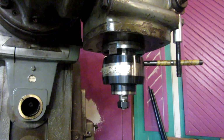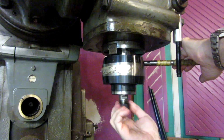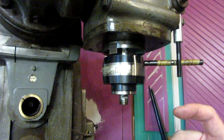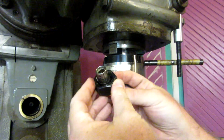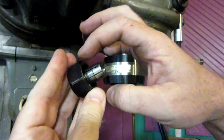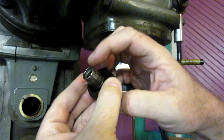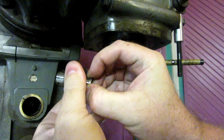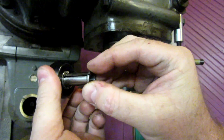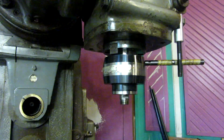The collet on the bottom here, I think, is a proprietary style collet. It looks kind of like a TG collet, but it's too long. And then so there's the collet, and it clips in. It has a wire ring that goes in here, and it clips in. And then that collet's permanent. And then what you have is little accessory collets that go in here that neck this collet down to, in this case, 3/8 of an inch.